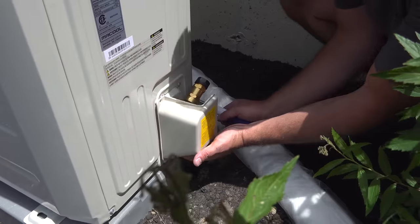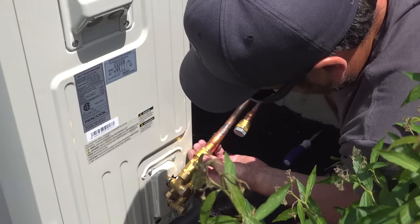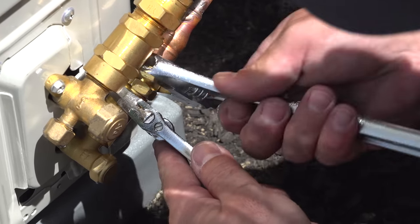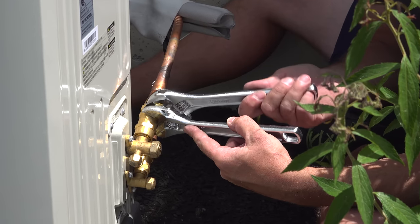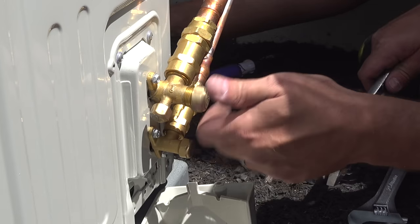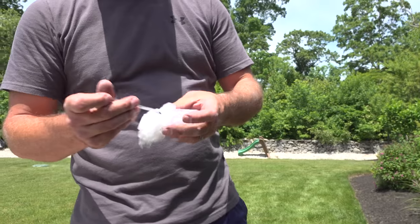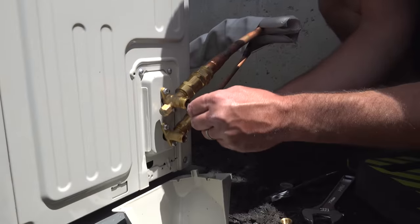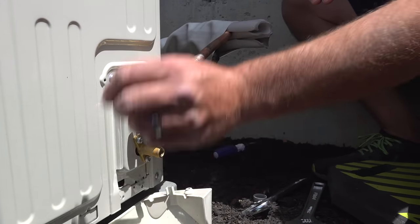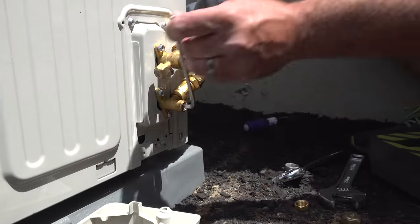To connect to the condenser, remove the protective panel with a Phillips head screwdriver. The biggest tip: only remove the black and gray caps at this time — those connect to the black and gray caps on the lines. Don't touch anything else until you've completed this step. Once lines are connected and tight, the freon is still inside the condenser itself, so you need to allow it to flow into the lines. Remove the two brass caps on the end of the valves — underneath there's an Allen screw. Turn it counter-clockwise completely until it bottoms out and you'll hear the gas begin to flow into the lines. Repeat for the other line and leave that screw in the outward position — do not tighten it back up.